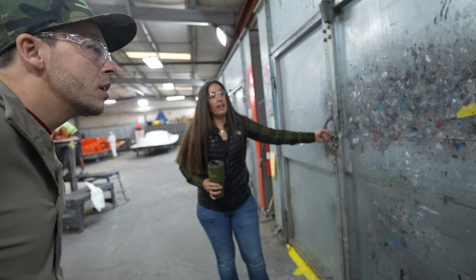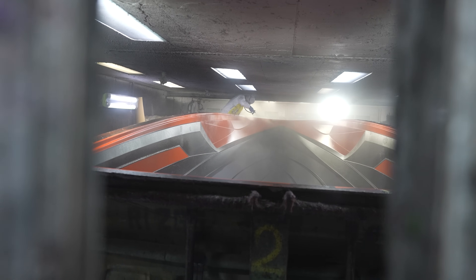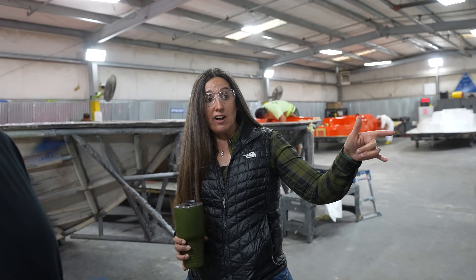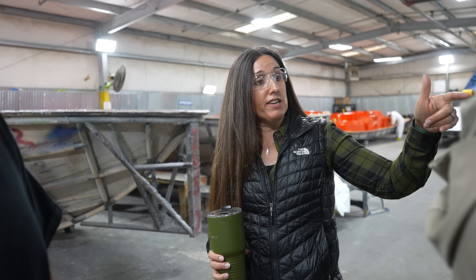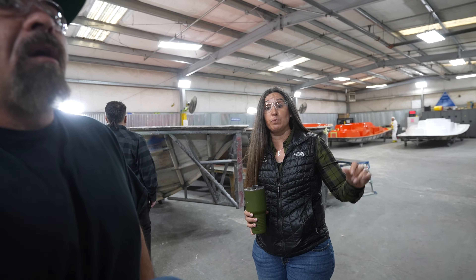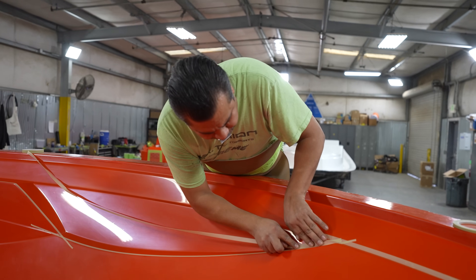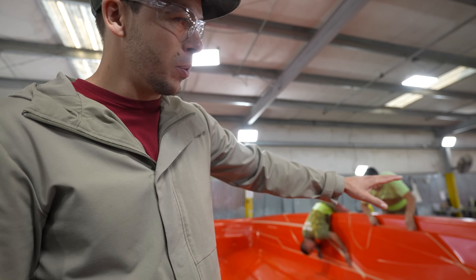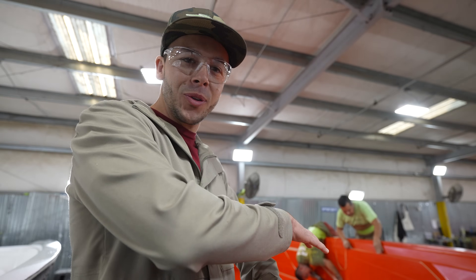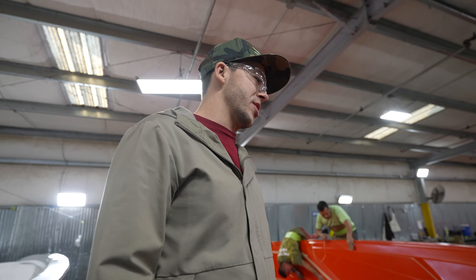They're gel coating here — look at that, and look at the gap between the top of that mold and the ceiling, that's all they've got. They've already sprayed the base color on this boat. This is a two-tone scheme; they've already sprayed the base which is black and they are now spraying champagne metal flake on this boat. He's hanging into the boat, taping upside down and backwards, hand-taping the complete pattern, masking everything off, then spraying a different color. I had no idea the process was done like that.